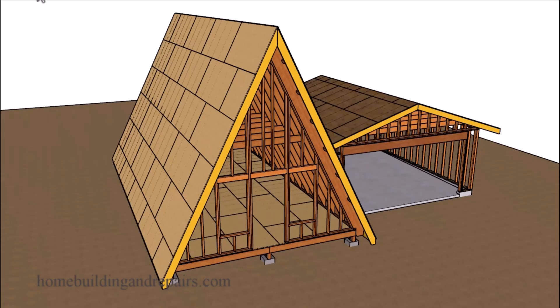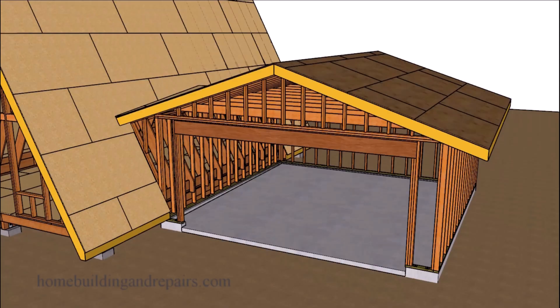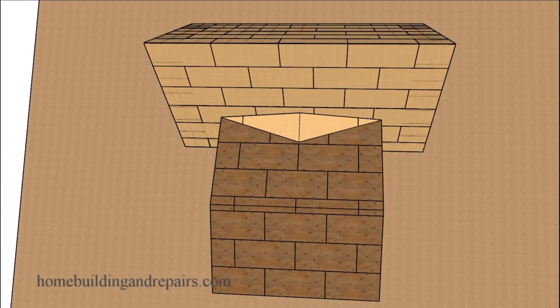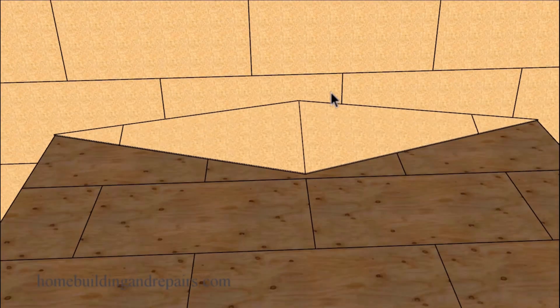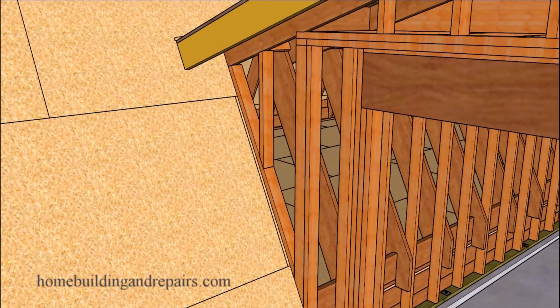Let's go ahead and add a two-car garage to our A-frame house. Keep in mind that these assembly methods might not work in your area, and there are other ways to attach a two-car garage to an A-frame house. I will be providing a couple more examples in our series. We're going to use a roof cricket to provide drainage so that water doesn't accumulate in this area. For those who live in areas where it snows, this might not be the best method either.